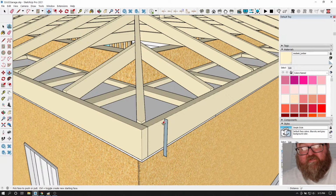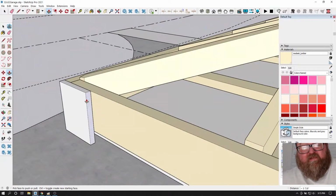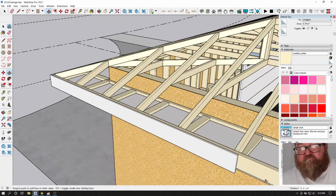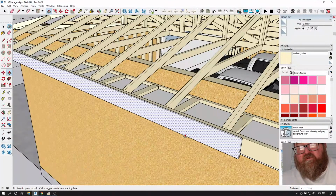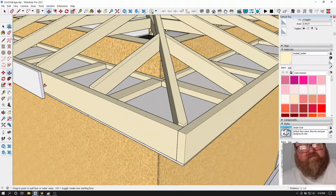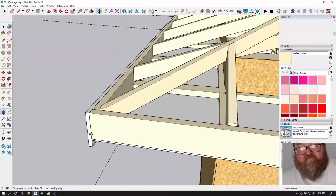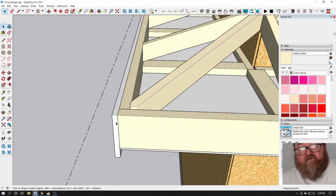So I actually approach it this way: if you told me that you wanted one of the projects that I have already done, I might use the containers, but I would start from scratch, because it's kind of dangerous trying to rubber stamp projects. A good example is where it is in the country. Up north, you might have to have a 5 or 6 foot deep footing, and down south, in Tennessee, our frost line is 4 inches or something, so our footings don't have to be as deep. So if I was just rubber stamping drawings, I would really be doing a disservice.